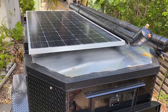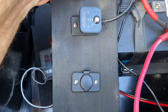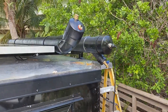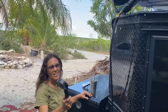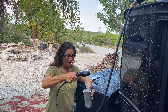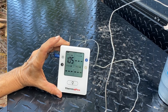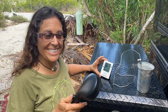The 12-volt shower heating element is plugged into one of two 12-volt ports wired with fuses to the battery bank. We'll turn on the water heater for about four hours and see how hot the water gets. The pressure is awesome — it's very hot. After about four hours of heating, we're reading 105 degrees, powered by the sun. Gratitude to the sun, and gratitude to my husband Jeffrey for being a genius.